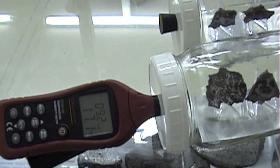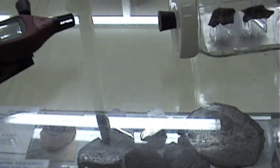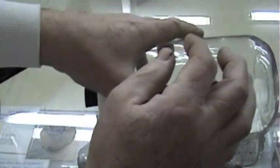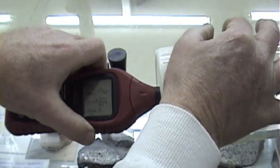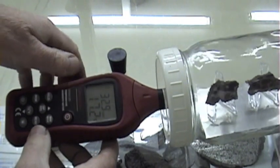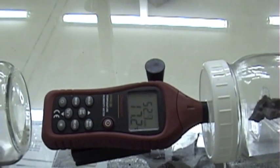The humidity is quite low with the 4A molecular sieve desiccant in there — looks like less than 9% RH already. In the other container with the water, that should get to 100% relative humidity, kind of by definition. Let's pop the cork and have a look — it's at 48%, 49%, 50% and climbing. I think I got enough water to fully saturate the air inside the bottle, so that should reach 100% relative humidity once it's equilibrated.